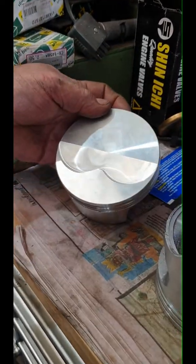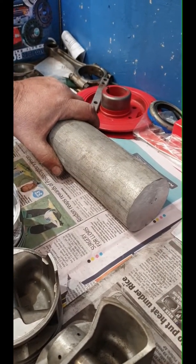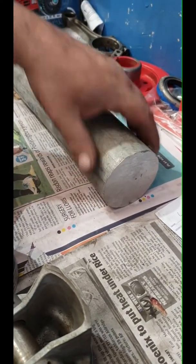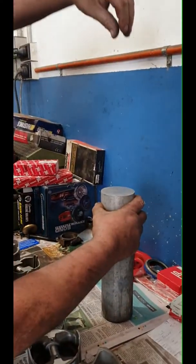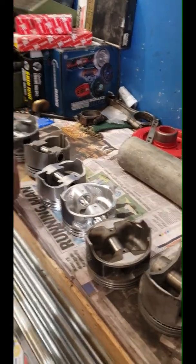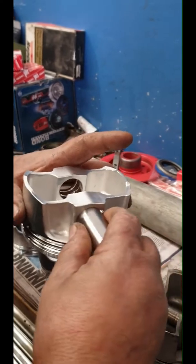What's this? There's a big lump of metal - this is what pistons are made out of. What they do - they cut billets out of it. They cut chunks about this big, heat them to 600 degrees, put them on a press and smash it down into the centre so it sits up like that. The billet's in a die and this big plunger comes in the centre and goes bang, hits it - it's like play-doh at that temperature. It does roughly this shape, and it squeezes out - it might be that long in the end, bigger or whatever, but it hasn't got all the detail yet. Then they do the machining on the CNC. That's why forged pistons are very expensive.